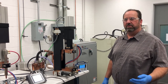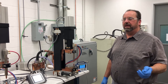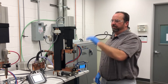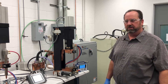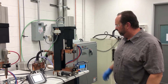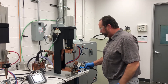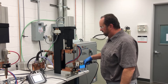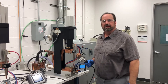With the previous weld's force timing, we were firing too early — the force had not settled and we were still firing on the up-ramp of the force. This can cause inconsistencies in your welds. We're going to add more time to the squeeze and we've already adjusted the weld control. Let's go ahead and make another weld. You'll notice it took a little bit longer for that weld to occur.